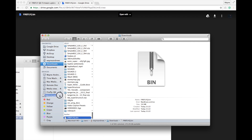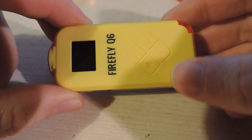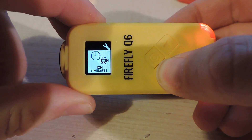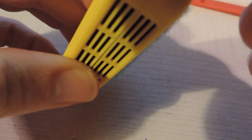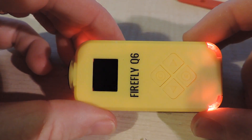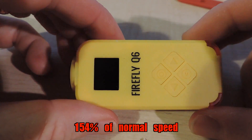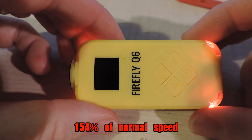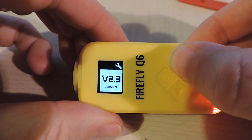After you download it, you need to wipe everything off your memory card and then place just the firmware file you downloaded onto it. So here's my Firefly with the newly replaced OLED. As you can see, it's currently on firmware 2.2. All we need to do is power it off, stick in the SD card, and power it back on and it will update. You get a nice load of flashes from the LEDs to tell you it's doing something, which gives you a nice feeling. One thing to remember: after you've done the firmware update, you need to delete that file or just format from the menu — because if you turn it off and back on again, it will start doing the firmware upgrade again even though it's already on that firmware.